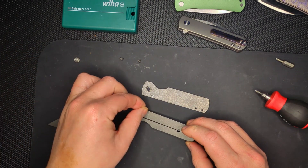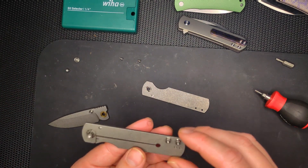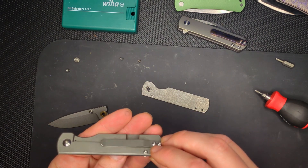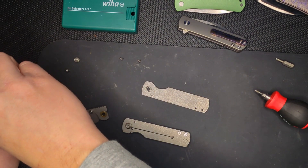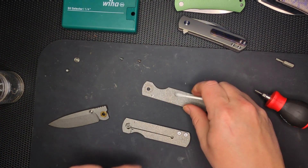The pin just fell out, which is fine — having the back lock pin be free is okay. The back barrel bolts were not free-spinning for me, which is good, so it was easy to take apart there. Definitely have some grease in here. It's thin behind the edge. I think the MagnaCut is heat treated correctly, although I don't know that for sure, but in general MBK is good about getting their heat treat done really well.